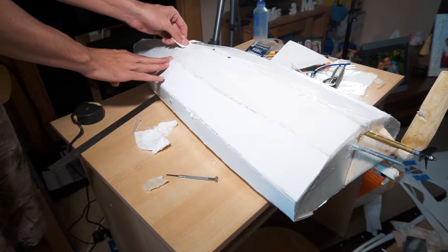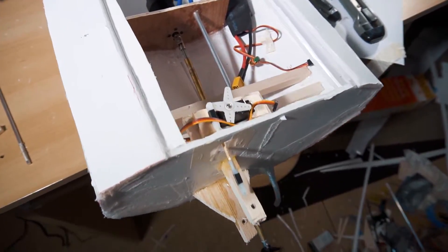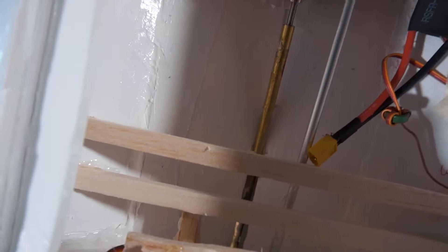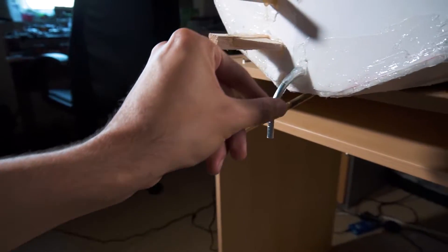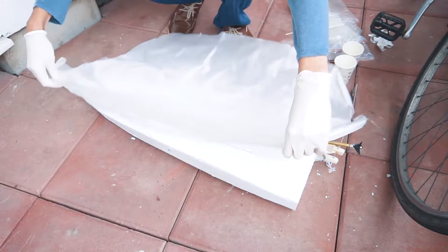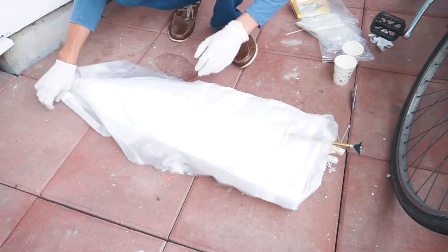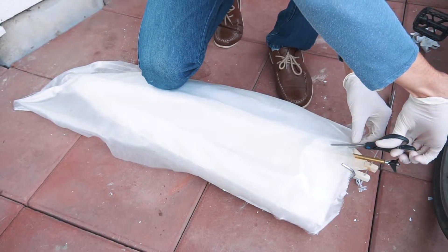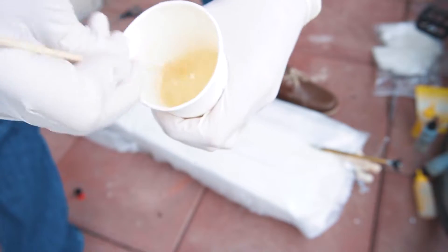The paint coat wasn't very helpful since this foam board has paper-like layers that dissolve after long exposure to water. So I continued with the main modification, which is lowering the propeller shaft a bit more. I'm afraid of lowering it too much because it can cause instability problems, but we have to test it. I also bent the aluminum tube so it picks up the water instead of being the exhaust of hot water. Another important change I did was to cover the hull with fiberglass, which will make it completely waterproof and also give it rigidity and durability.